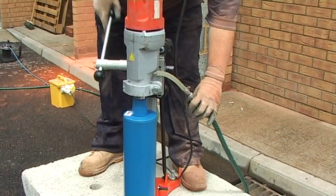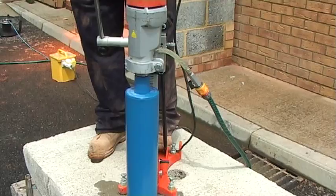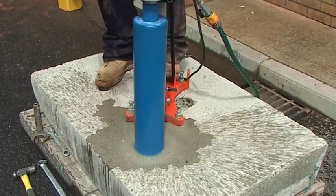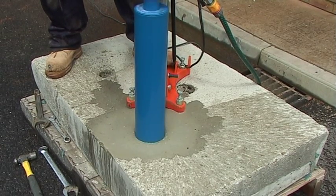However, the popular demand for drilling rigs and motors means that most tool hire firms operate a fleet of suitable equipment for general users to hire. The simple basics for successful wet core drilling are having a rigidly set-up drill rig, constant water flow and the right speed, range and power for the core.